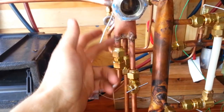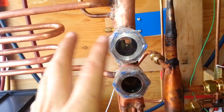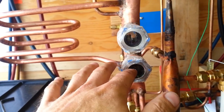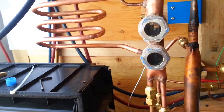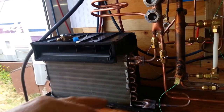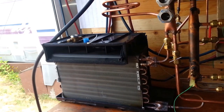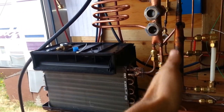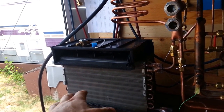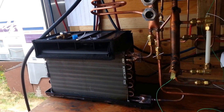To review: there's a line feeding liquid from the separator column to the bottom of the coil, and a line coming off the top of the coil into the upper space of the column to separate vapor from liquid. I terminated it at the top rather than the bottom to keep the liquid in the bottom as calm as possible. The amount of circulation through there is dictated by a lot of variables — hopefully enough that vapor pockets are quickly washed away by liquid movement, driven by the difference in static head between the liquid side and the lower-density vapor side. It's somewhat like a thermosiphon solar water heater, but with the added effect of phase change, so it's going to be more violent.